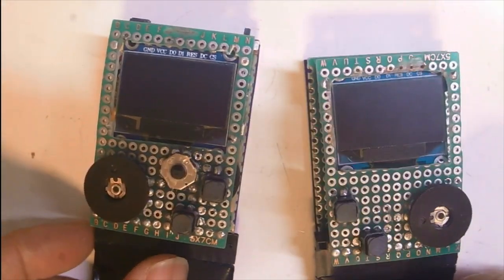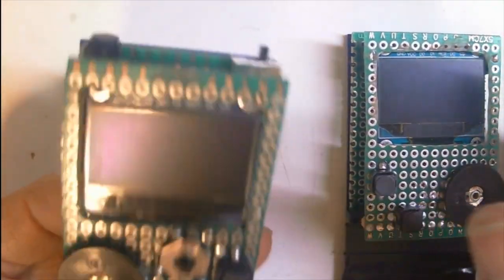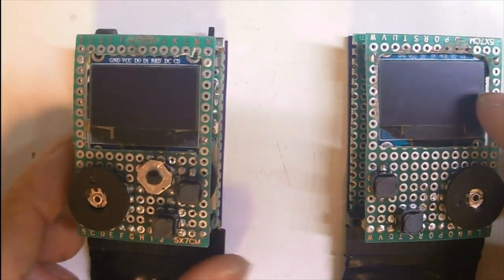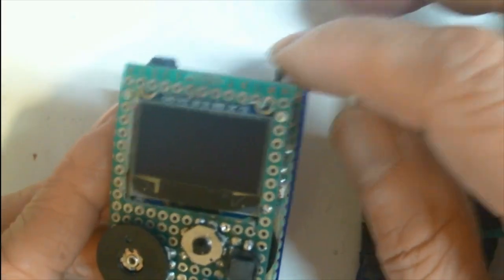If you go beyond that, your serial flash memory may be impacted by the capacitance of this long wire, and it will function differently depending on what type of OLED you plug in. For some OLED, it won't even come up. So I matched these two and found a 2 feet cable that works quite well.